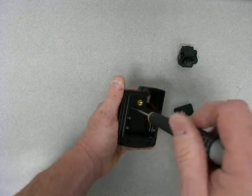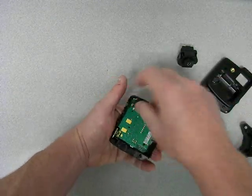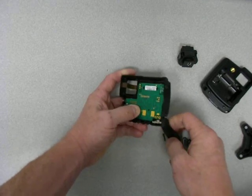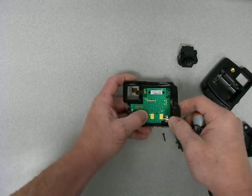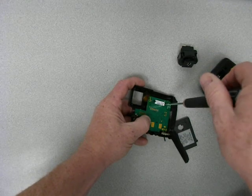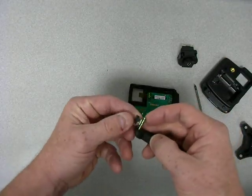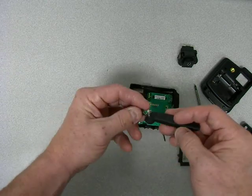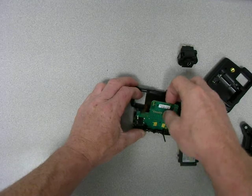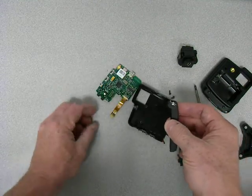Get all the screws out and it'll come apart. Inside we have this circuit board. You can see the antenna will now flip out. There is foam on the back side, so it sometimes does stick. Alternatively, we can just take these two screws out and the circuit board will then come out, but then you'll have to deal with the switches, which aren't important for what you're doing. So here's the current antenna clip with foam on the back, so it contacts the back of the case and takes up some space, ensuring it has sufficient contact on this antenna connection right here. This is how the antenna is hooked up.